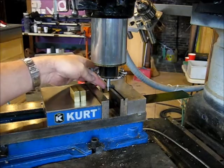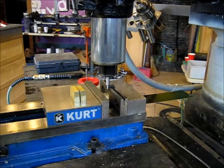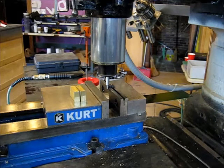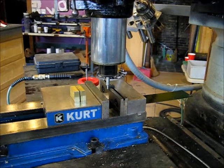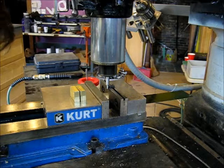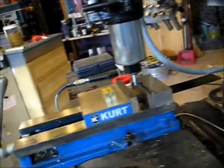Now what we're going to do is pick up this X zero here. So get it in close to the jaw, and then run it down, and again, come in close. Watch for the jump. There we go. Enter our zero. And then let's double check. Again, watch real careful. Boom. So there's our zero again. Check our DRO. There we are. So we have our 0-0